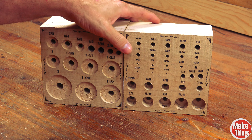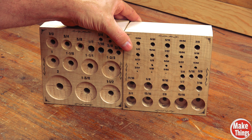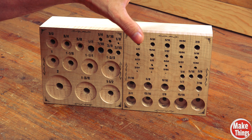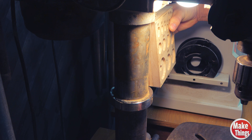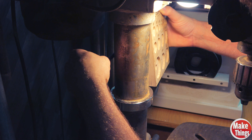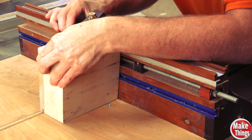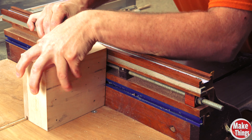Back at the bench, you can see it's just a slight angle. I'm happy with this. Even though I'm making this to attach to my drill press, you don't have to - it'll work fine next to your drill press. You could even make it one solid piece instead of the two separate blocks. Since I'm attaching this to my drill press, I'm going to cut two channels that work on both the front and back of the column. Because I've cut the angle on the bottom, I'm using my sled to cut the channel - you would not want to cut this against the fence.